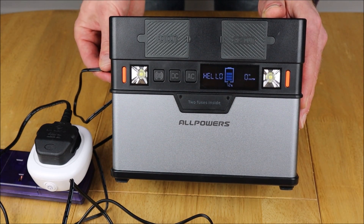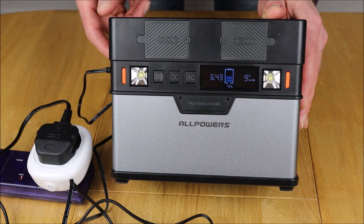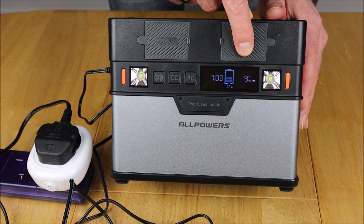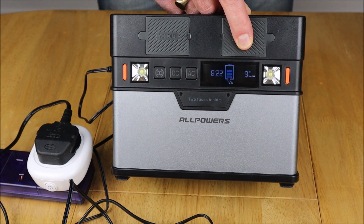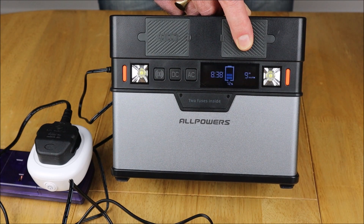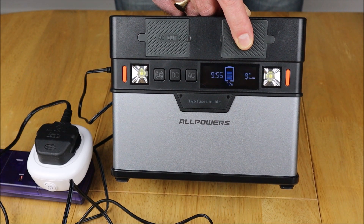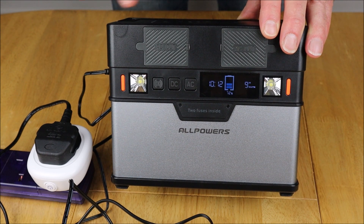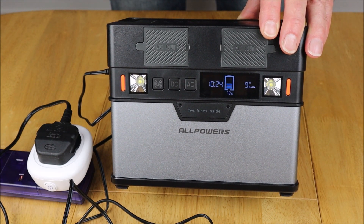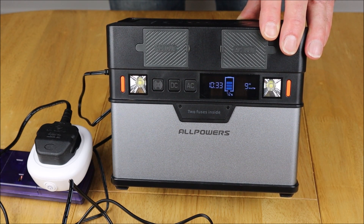This isn't normal behavior, but it might explain some of the things you'll see later on regarding solar. I plugged it out and back in again and as you can see it's only nine watts, which makes no sense at all. I'll flip back to my mobile phone to confirm it's not a misreading on the battery itself. We're back — that's capped at nine watts, and as you've just seen on my phone, it's not a brick issue. So I'm going to switch over and simulate charging it in your car using my other solar generator and show the behavior on that as well.